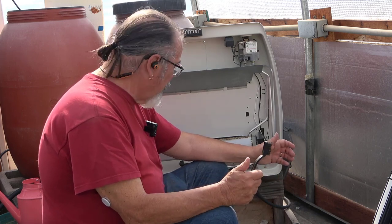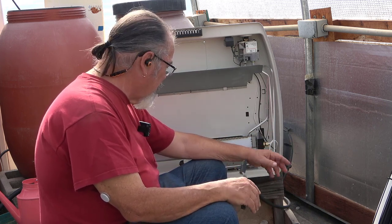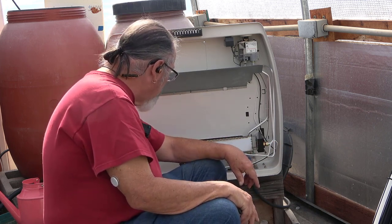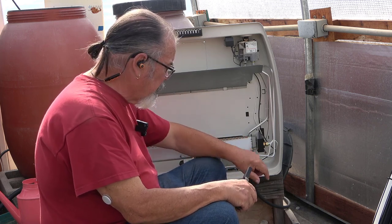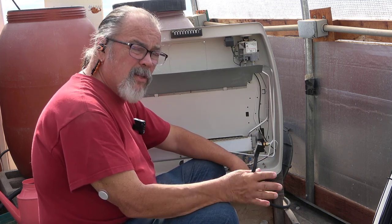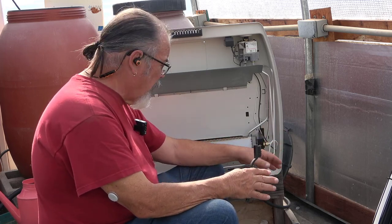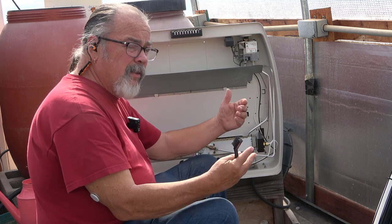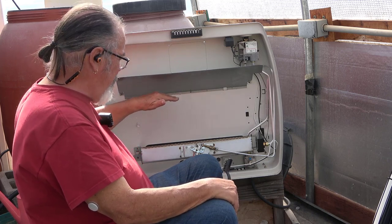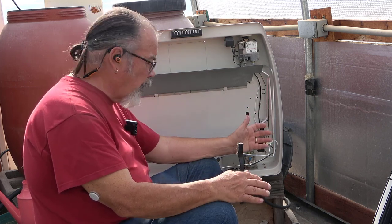About 20 minutes of brushing on this burner tube and I have all the dust and corrosion — mostly rust — off of it. It's probably steel. When I fired this burner up yesterday, I could see the yellow flames coming up about three quarters of the way to this baffle, but it wasn't coming from every single burner location — it was coming up here, here, and one over here.